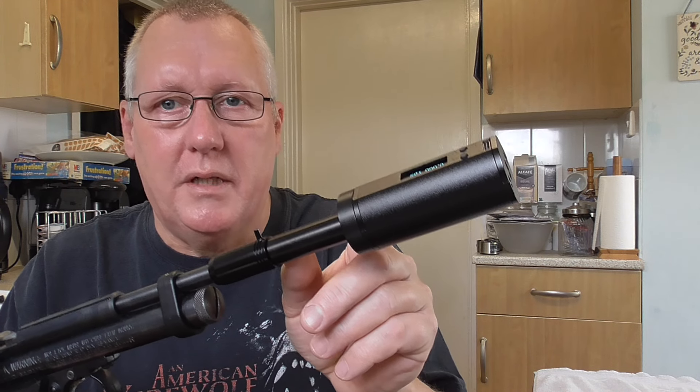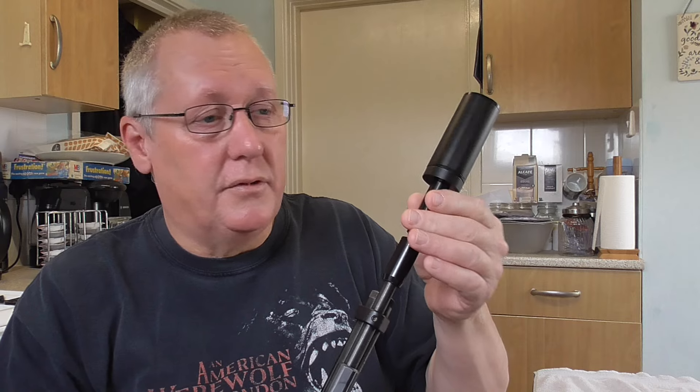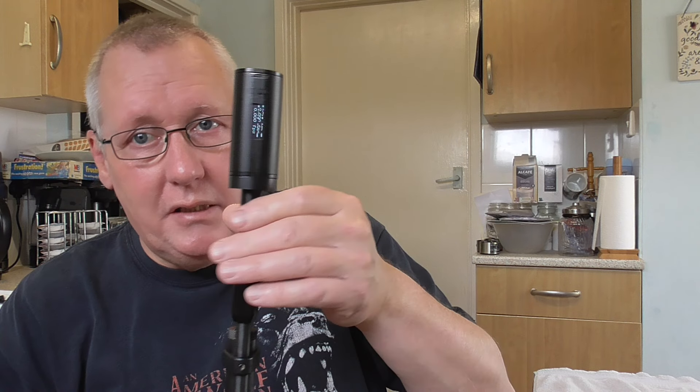That's two inches, that's 50mm. You can get 38mm but they were out of stock. So that's how that fits. That was the only issue I had with this chronograph — fitting it squarely. Because obviously it needs to be square: when you fire a pellet through, if it's not square you're going to clip the inside, damaging the sensors and so on. So I keep that adapter in the case to go with the chronograph.